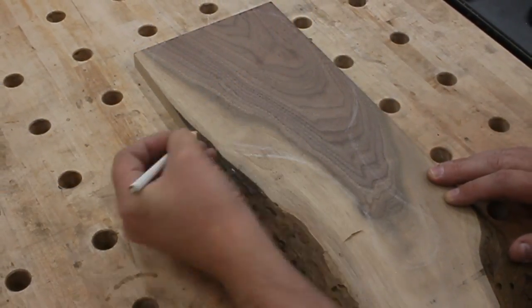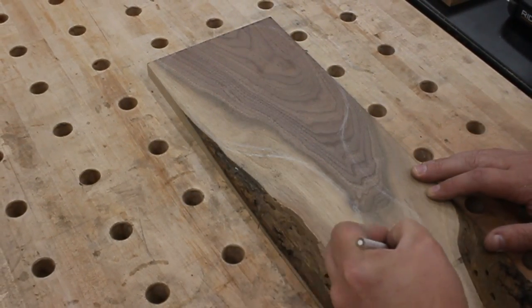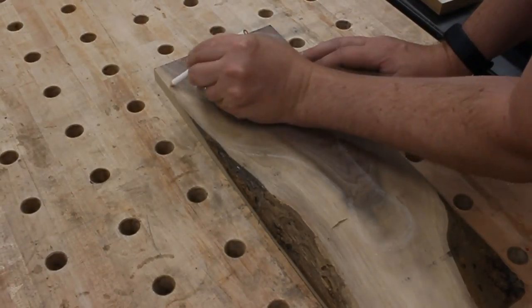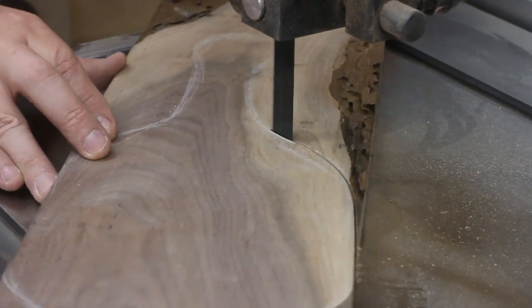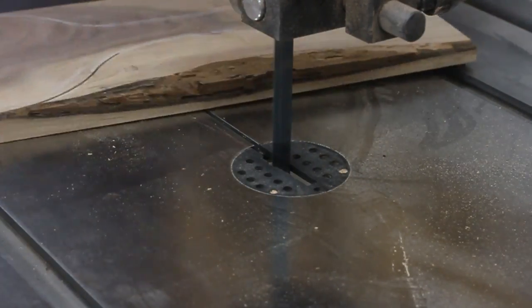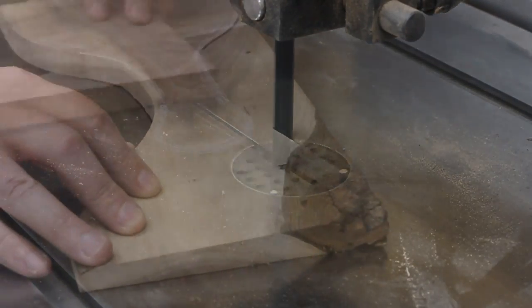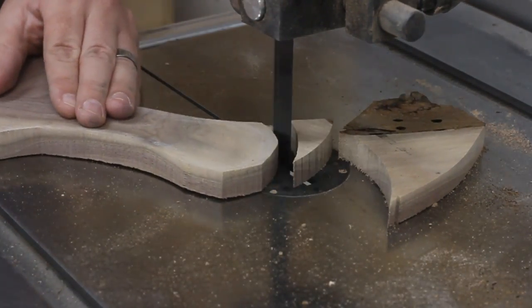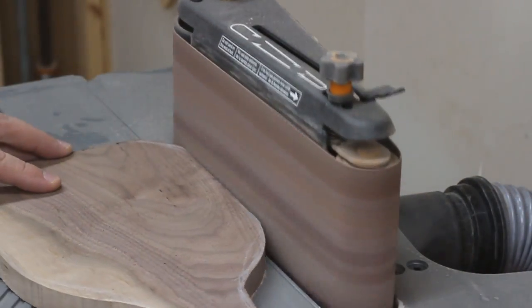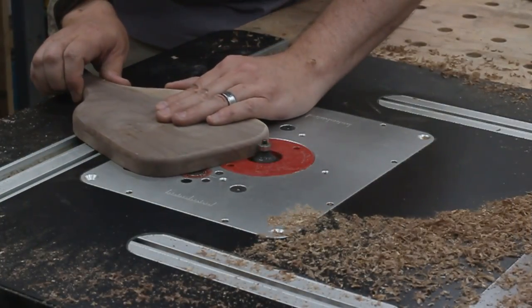I started by sketching out the shape of the main paddle on some freshly planed walnut. I just free-handed this, but I probably shouldn't have because it turned out a little asymmetrical — my eye kind of twitches a little every time I notice it. Over at the bandsaw, I nip off the excess. Yes, I know I have the wrong blade on for this, but I was far too lazy to switch it out. Then the belt sander took off the bandsaw marks, and I could put a nice round-over on the edges over at the router table.